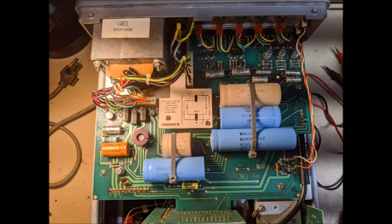This is the power supply board for the oscilloscope. It's located on the bottom of the scope, so I had to turn the scope upside down in order to get to it. Whenever you work on any type of electronic equipment, the first thing you want to do is check the voltage source. There would probably be several different DC voltages on the board, so you have to check each one of them.